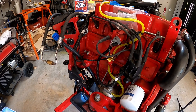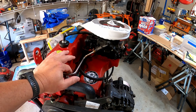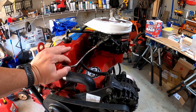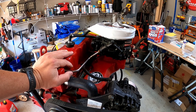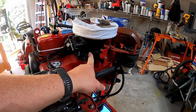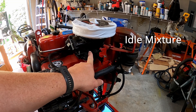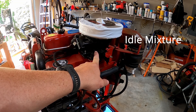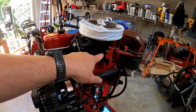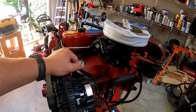I had the carburetors rebuilt — new ones from Flying Fish Carburetors in Florida. They did a really quick turnaround and the carburetors work great. One thing about these carburetors: from the factory the fuel mixture is capped off and you can't adjust it. The gentleman at Flying Fish said he sets these for about three-quarters of a turn and they shouldn't have to be moved. I noticed I was idling fast, and when I tried to adjust my idle back down it didn't want to run — maybe because the bearing was causing drag on the engine.